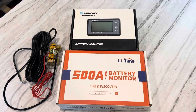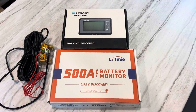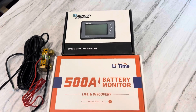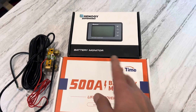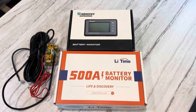You'll need a way to monitor your battery's capacity. With lithium iron phosphate, the voltage and charge curve, it's kind of hard to do it just by going by the voltage. So you'll need something to do that unless you want to do a bunch of math. Luckily, battery monitors and shunts are available on the market for an affordable price. The little computer does all the calculations for you — you don't have to do it on paper to know your capacity and charge and discharge rates on your batteries.